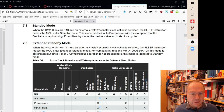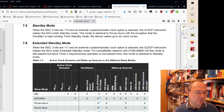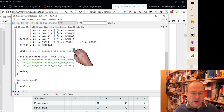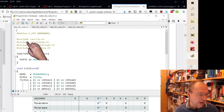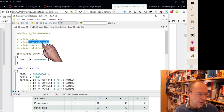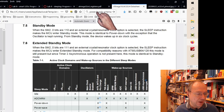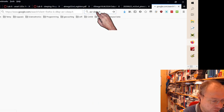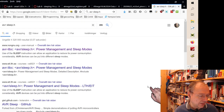In order to make sleep modes easier to handle than going into the registers ourselves, there is a library which I briefly introduced on the last slide of the previous lecture. In the source code here, which I will right away copy into Atmel Studio, I'm including this library, and we can see if we find more information on it as well. avr/sleep.h gives us the documentation